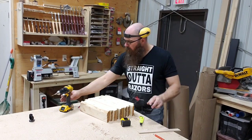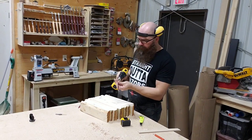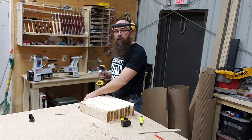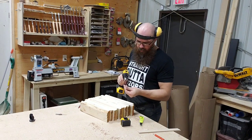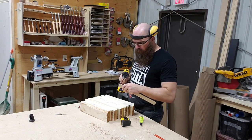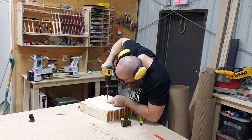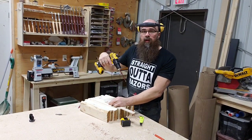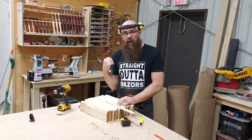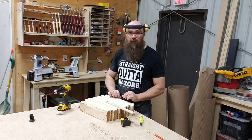Okay. So, from the center of our bowl is where we want to put the pivot. So your first hole that you drilled is your pivot point. So you put your pivot point in there. Now you don't need to worry about this because we're putting an auxiliary block on. This is close to 4 inches thick. So by the time you get it on the lathe, the auxiliary block, our bowl is only going to be about 2 inches. So you got a good inch and a half to play with.